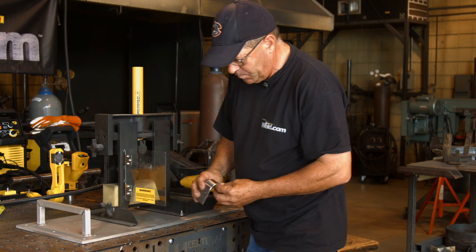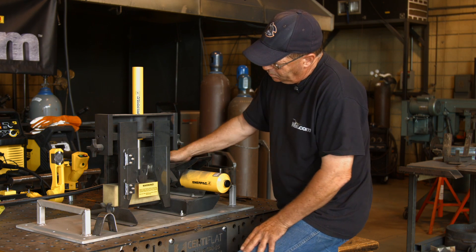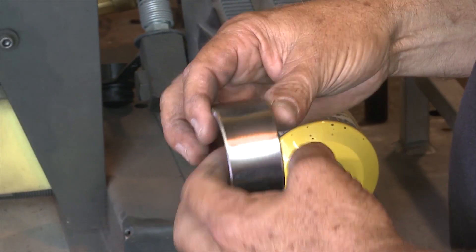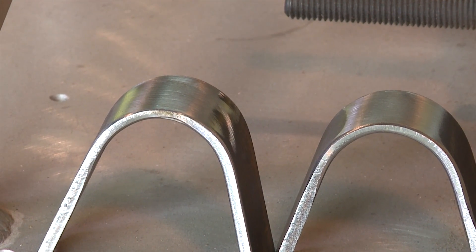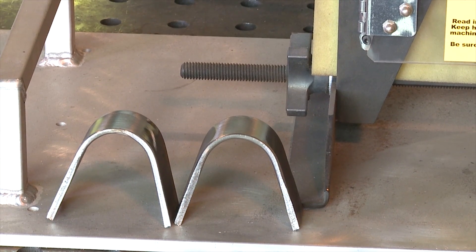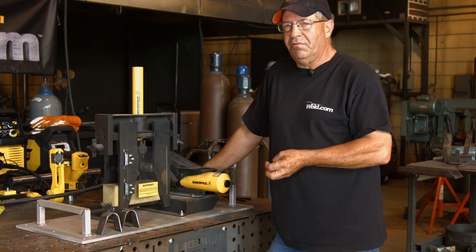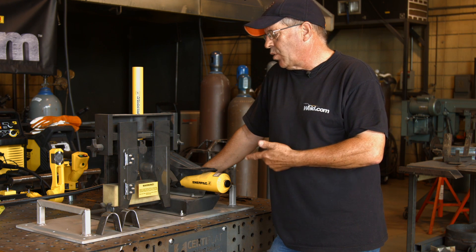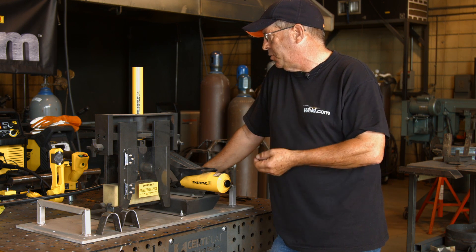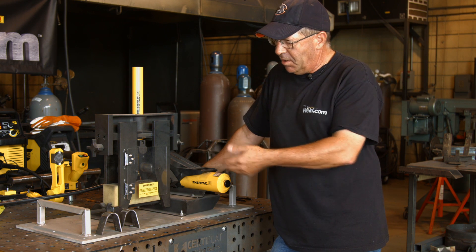Clean coupon. Again, the whole deal was running this machine for the first time and I ran it down a little low because I was on 3/16" groove material going uphill. If I was going downhill, I would have probably turned it up a fair amount — I'd say 17.5 instead of 16.5, probably pushing 18, more gap, more wire, and run quicker. Since I was going uphill, common sense tells you the pool is going to be under the effect of gravity, so I cooled it off a little bit and we came up with good clean coupons.